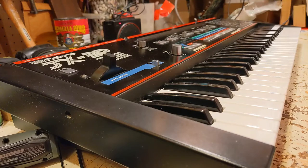I've completed work on this JX-3P. It really just needed some cleaning of the keybed. Some contacts were not working for a few keys. I took it all apart, cleaned all the contacts, and cleaned all the keys for that matter.